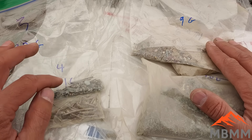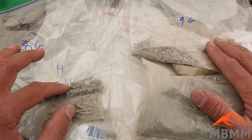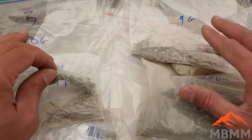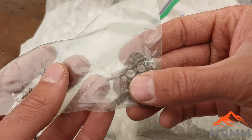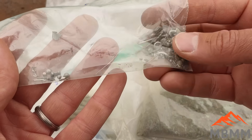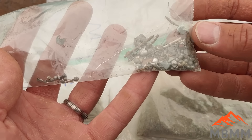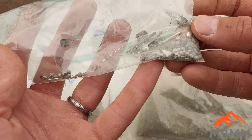We'll put them in our electric furnace and get the lead melting. The oxides will drive off and take with them, hopefully, a lot of the base metals like the copper and aluminum and zinc and stuff like that. And then we'll be left with our precious metal beads. So that's kind of our process, so let's get started.